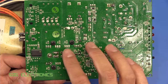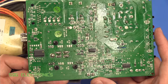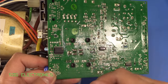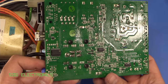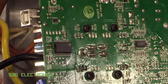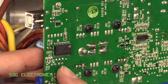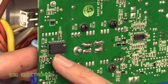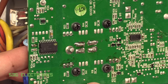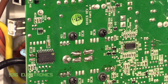The back of the PCB has clearly been wave-soldered, though there are also a few hand-soldered parts. It's got a really uneven conformal coating applied — it looks like it's been vaguely brushed on rather than properly applied. Normally you get a nice even sheen across the PCB. There's also a USB connector on the back which interfaces with a PIC 18F14K50 — a nice little microcontroller with a USB stack. It probably communicates with the main microcontroller via UART and allows computers to shut down gracefully via the USB connection.